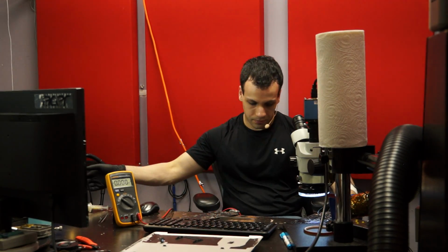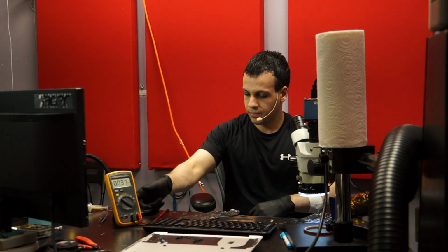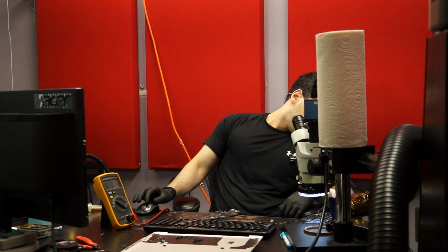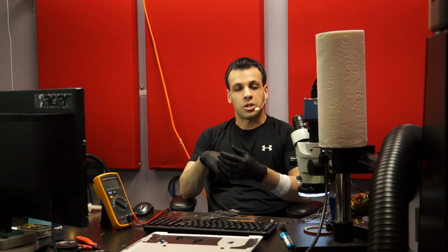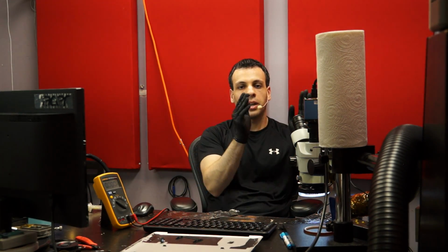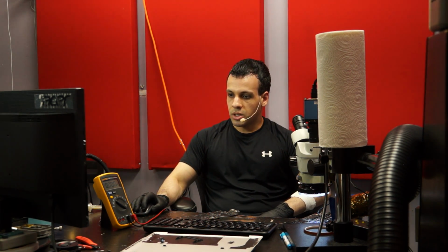So, let's go over what we did, and why. We didn't have a green light on the charger. The first thing I check there is to see if PP3V42 is present. One of the things that I tell all of you is to check the beginning and the end of a circuit rather than following every single little step, because it will waste a lot of time if you do it that way. So let me go back over here and show you where within the one-wire circuit.